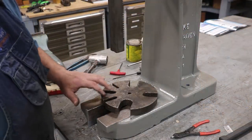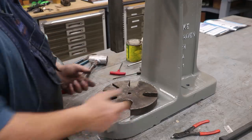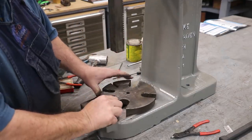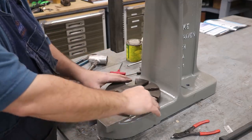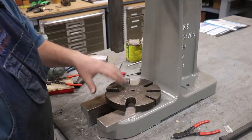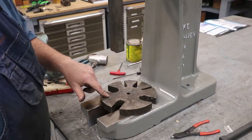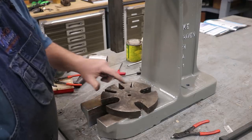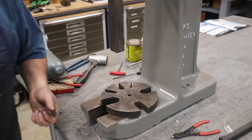Next thing is we've got the daisy wheel. The daisy wheel sits here and it's designed where there's a pin that rotates — the pin is missing. There's a hole there, and this rotates around. Depending on what size shaft you're pressing, or if you just want a flat place, you can turn it to a position that suits your job. It's kind of beat up, so I think what we're going to do is take this over to the lathe. I'm just going to face the two faces on here to get it cleaned up, and then we're going to get a pin put back in there.